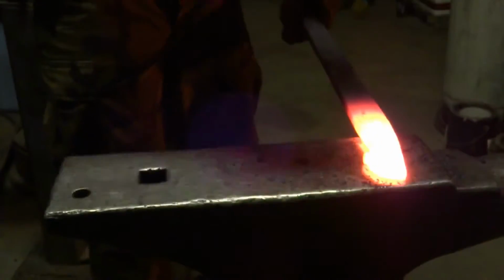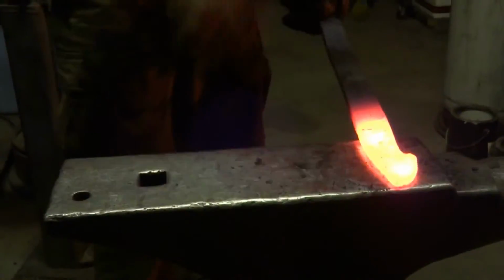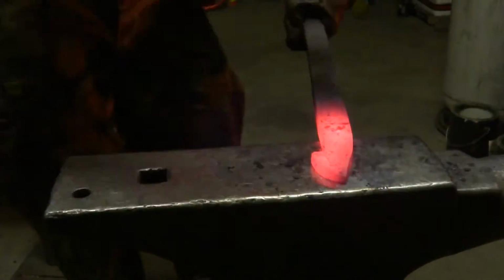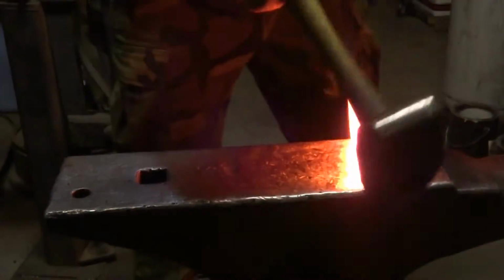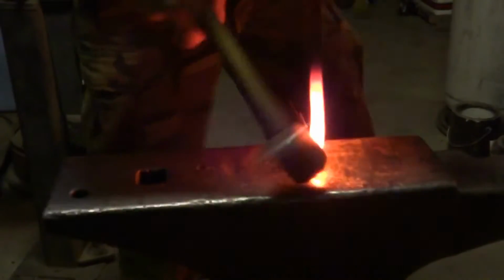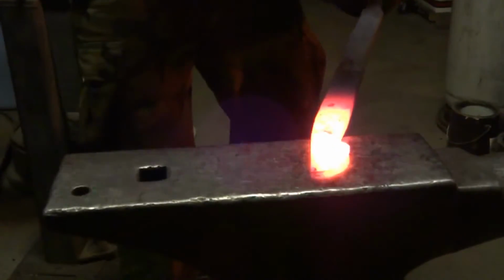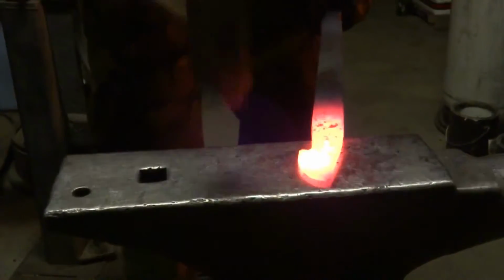I mean, I'll forge profile or even bevels at a welding heat occasionally if I think that there's some issue with one of the welds being delicate, but even so, I'll follow it with forging at lower temperatures and then normalization, because you don't want that grain pattern from forged welding heats in your finished blade. I mean, that grain size really, it makes it weak.